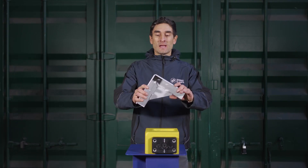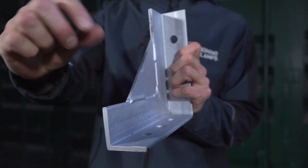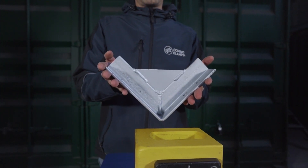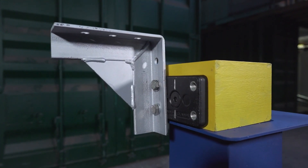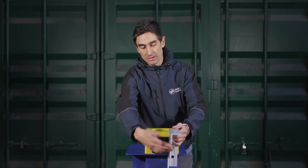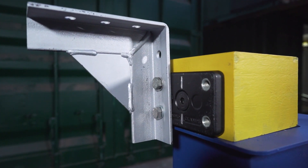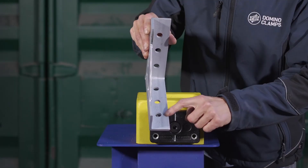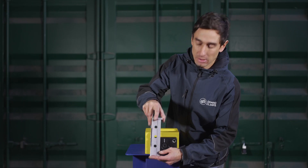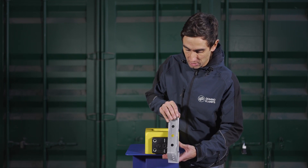Next up, here we have our three-hole gallows bracket. This has been made from 50 by 50 by 6 millimeter steel section, welded to a right angle with a haunch plate for added strength. Each of these arms is 200 millimeters long, so it will reach out much further than any other kit in our range, and this haunch plate will make sure that whatever weight is put on there is nicely supported. The gallows bracket features three 50-millimeter spaced holes for lining up with the M12 threads on the Domino Clamp, meaning you have two heights to set it at, and a further two by flipping the cantilever arm to the bottom.